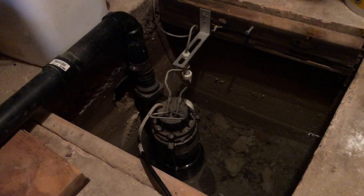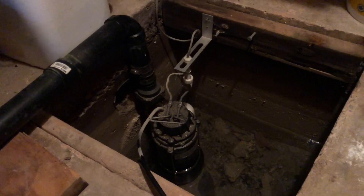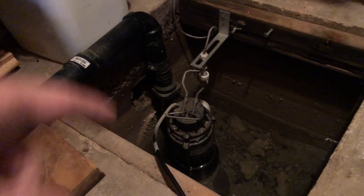What they said was possibly we need to put a weeping hole in one of the pipes, and to be on the safe side I'm going to change the check valve and see if it works. I'm going to undo this one and then lift it up — you're going to need an 8 mil for that. Let's undo that, then we're going to take the pump out.